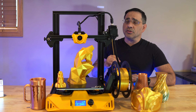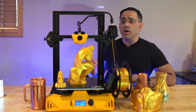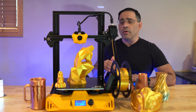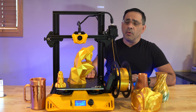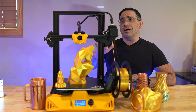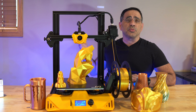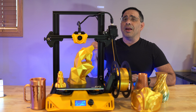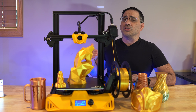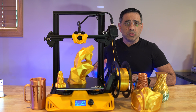This printer features manual leveling, so there's no BL Touch assistant and no auto leveling, but the manual leveling worked well. I've been running the build plate around 70 and the print at 210. That's because where I have my printing taking place, there's a lot of airflow and it's pretty cool, so I want to keep things hot enough for good adhesion and good print. No issues whatsoever.